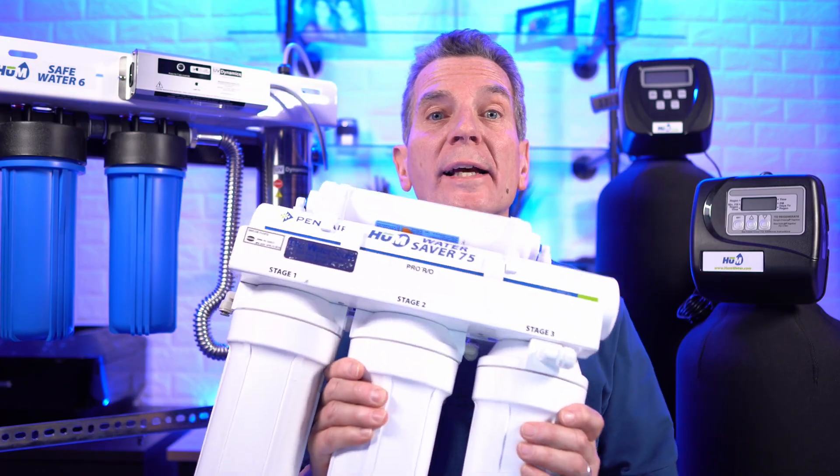In terms of maintenance for those ultraviolet disinfection systems — from the Hume Safe Water 6 all the way up to the E4 — the UV lamp needs to be replaced after 12 months of use. If you use your cottage year-round, replace it once a year. If you use it for six months a year and unplug it, you'll get two seasons out of it. The system has a timer built in that will notify you when it's time for replacement. The filters also last a year, though if you have a lot of sediment or sand in your water they may clog sooner and need more frequent replacement.